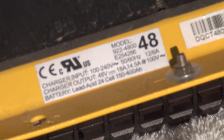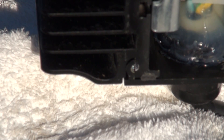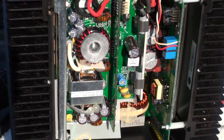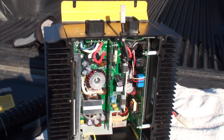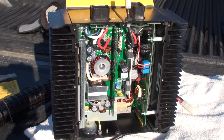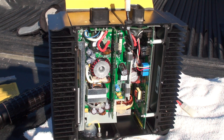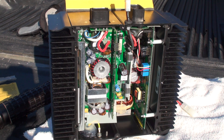I think it's the purple wire — I'll have to check that. I just wanted to show you what the inside of this thing looks like. It actually looks like a very good unit, but those pinouts are just too small for the amount of power coming through. I should have just put some bigger plugs on the end of it. I've read about many different people who have had the same problem with these wires burning up — if they're burning up, it's because the plugs and pins just aren't big enough.